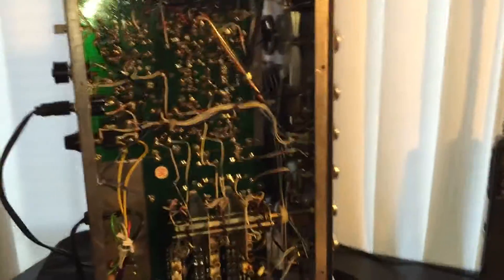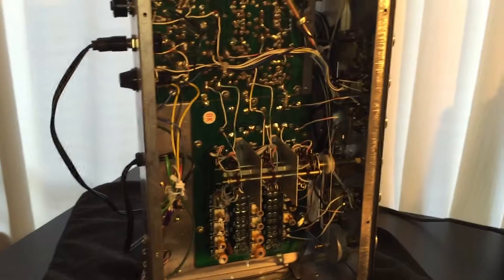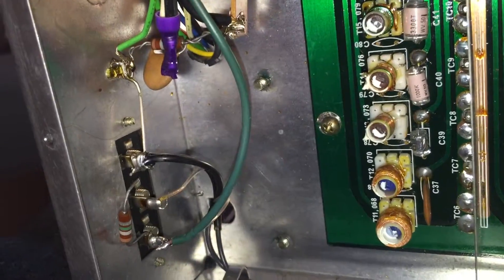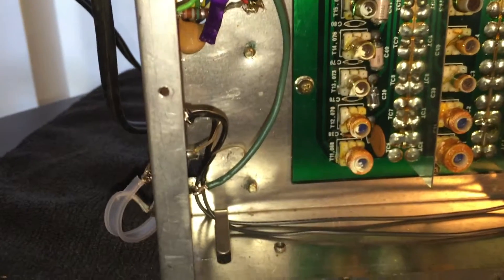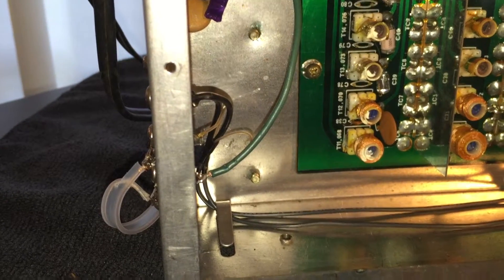Hello again YouTube, this is Remington H. I'm back inside my DX 160 after studying the schematic quite a bit more. I realized that I might have uncovered the problem I was having before — the problem that necessitated the screen wire I have connected to the antenna input. There's the antenna and there's the input. When I attached the screen wire to the tuning capacitor, I noticed that the sensitivity went from nothing — practically impossible to receive a signal — to quite strong.